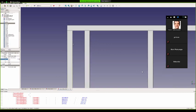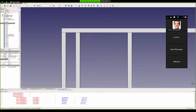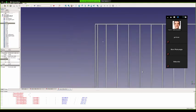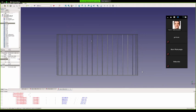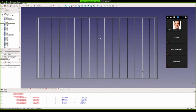So maybe we can divide this task up. That's good, that's great. Let's keep working on this. You're in the XY plane, that's good, so that when we raise it up, we just have to raise it up to the roof in our location file. And then how do we find out where the roof is? We already talked about where the second story floor is, right? We had that 121.125 thing. How far is the roof going to be above that? The height of the second story panels platform plus the wall modules on the second story.